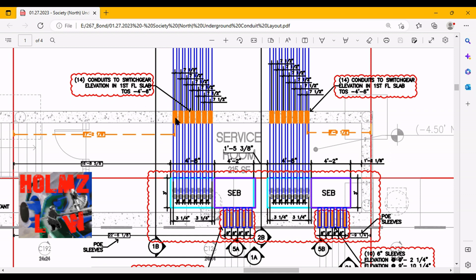In my drawings I have the center-to-center measurement for my sleeves, which is seven and a half inches for each sleeve. Once you find the first sleeve, the others fall right in line because you already have your center-to-center measurement. Your first step is to find an access line you can use to get your actual measurement. Sometimes the surveyor won't give you the exact access line shown on your drawing, but that's fine.